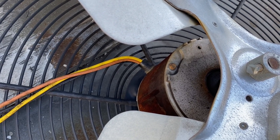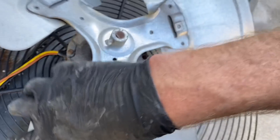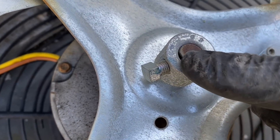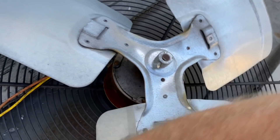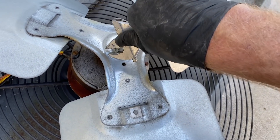US Motors has that flex connector on there. It is a direct OEM replacement for this motor - they did a really good job on it. Let's get the fan blade off - the fan blade is located flush. We'll get the fan blade off and then take the motor off the bracket. I put it over here in the shady part of the roof - work smart.